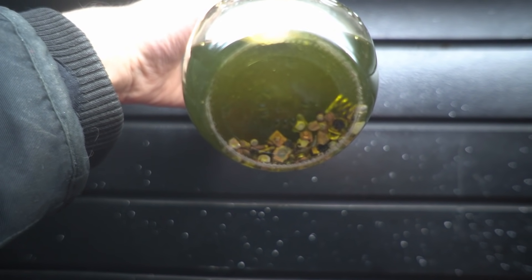Now I'm just going to have to let that do its thing for days, weeks — I don't know, however long it takes. It's a small batch though. A few other points about AP: it will get loaded up with zinc from the brass and tin from the solder and whatever else from using it this way. I don't know how those contaminants will affect it, and I don't really know how long it can be used before it needs to be disposed of. It cannot go down the drain — it needs to go to a hazardous waste disposal and that may not be free depending on where you are. It will also have small amounts of precious metals in it that you can recover, but we don't have enough time to cover that right here.